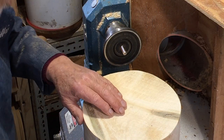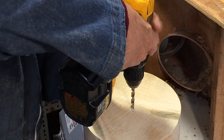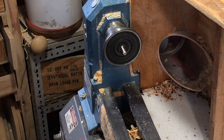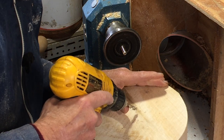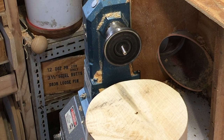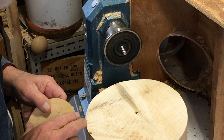So, to drill a hole with the drill, and it goes round, you can see some lines on, so I know roughly how deep I'm going. And when I got to the lathe, I realized it was silly not to cut out another blank while I was at it. And so I have two, and at this stage I'm only going to rough out these two bowls, and then I'll come back in another day or so when the surfaces of the blanks have just dried out a bit.